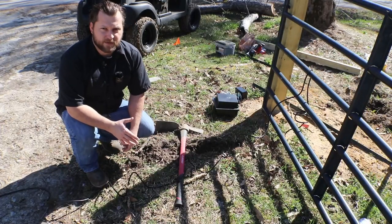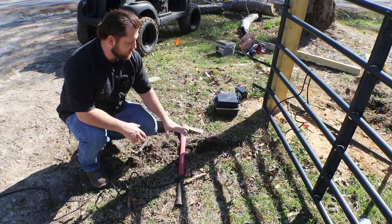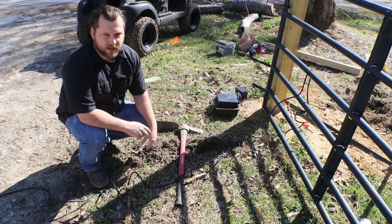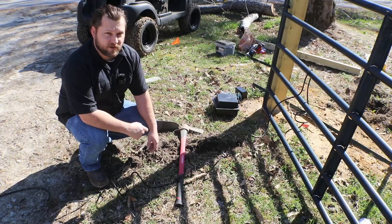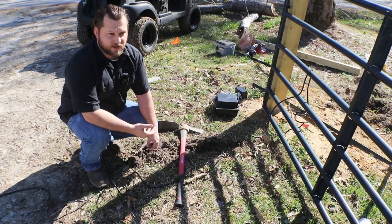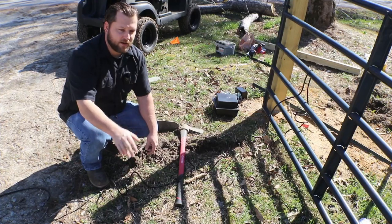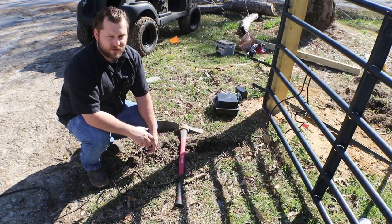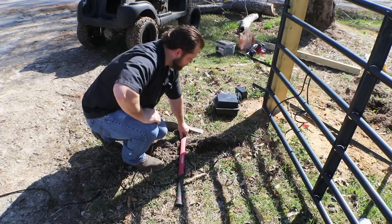All right, so another important aspect that I want to talk about and mention is if you have anything running through your house, utility-wise, water, internet connection, cable, whatever the case may be, and it's buried in the ground, be very mindful that they don't always bury them deeply, right? Typically, you would want to bury something 12 to 18 inches in the ground. That way, if anybody comes to grade it, anybody comes to aerate the lawn, it's not going to get hit. I assumed that AT&T would do that. That's who I have for a fiber provider. They did not.